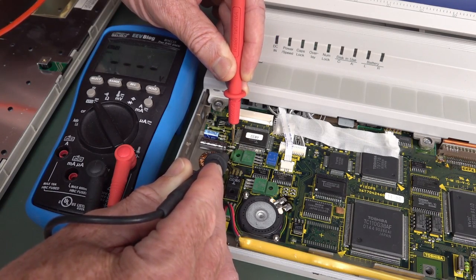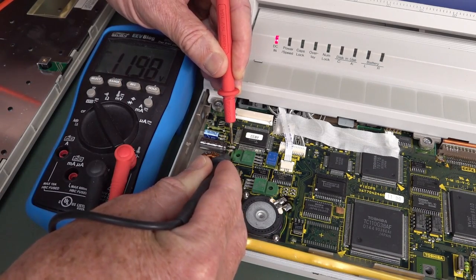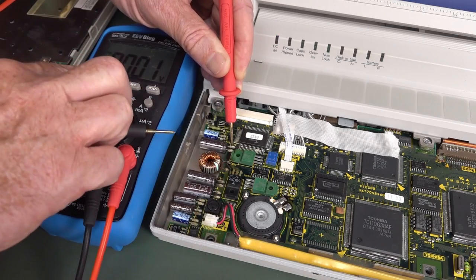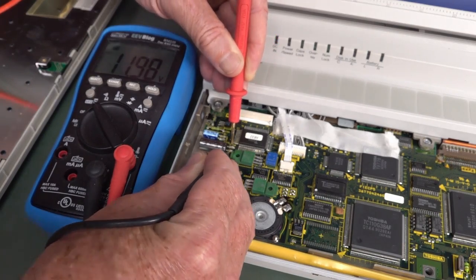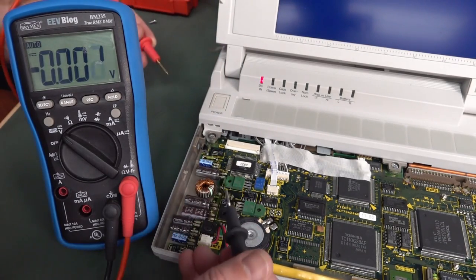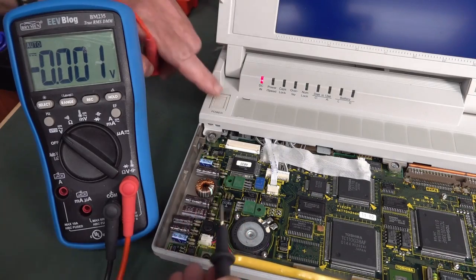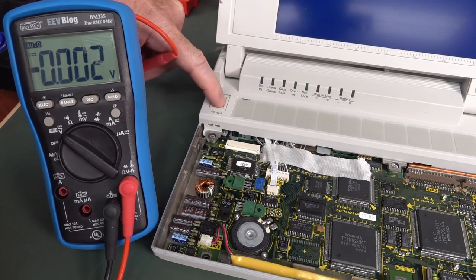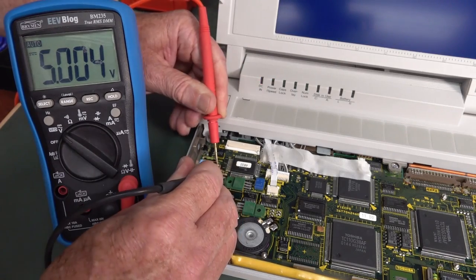This is where you've got to manually range the multimeter. Twelve volts - okay, that's our input. But why was it varying before? That was just nuts. Back to auto range - flickering all over the place. It looks like there's a lot of oxidization on those joints - that might have been it. We're getting 12 volts in. I can actually briefly get the LEDs to light up and hear the floppy trying to start up. There's a 5 volt rail.